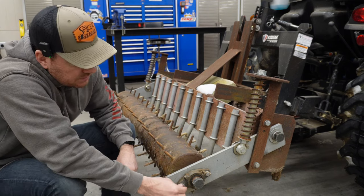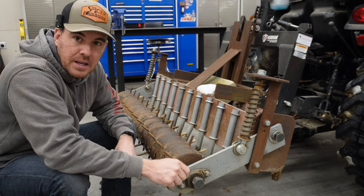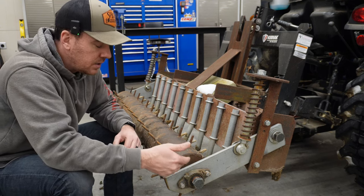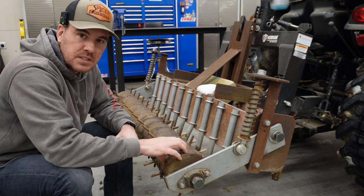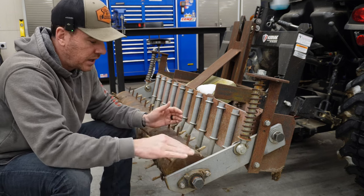Then I bought these flange mount bearings. These are greasable. I bought these off of eBay. Then I have a blank flange here that the fitters gave me for each side. Those fit right inside of the 6-inch fitter pipe. I welded a large backer nut to the back side of it that there's no longer access to.